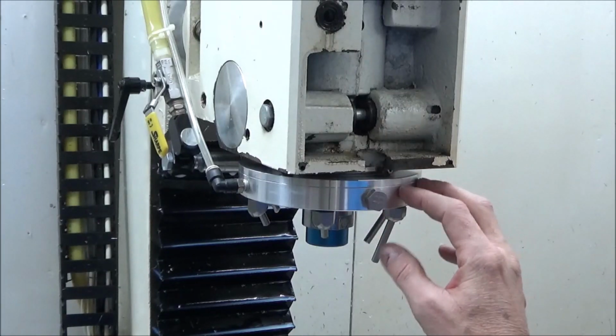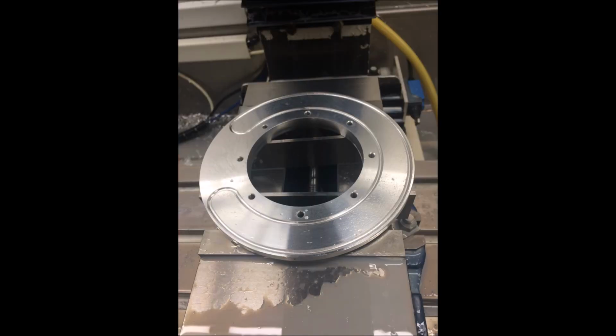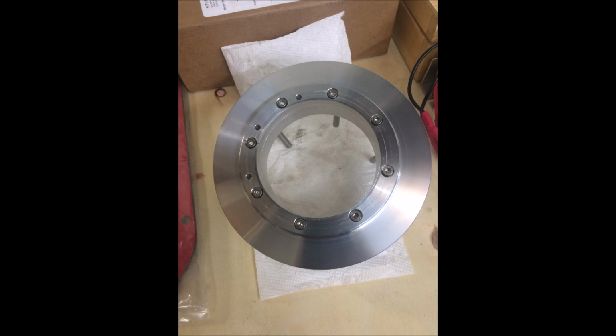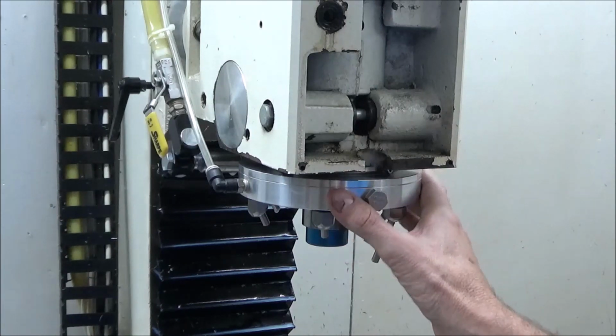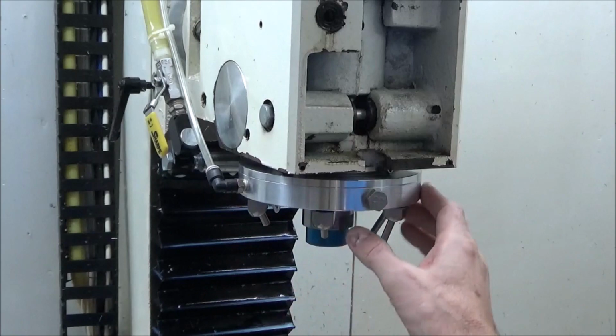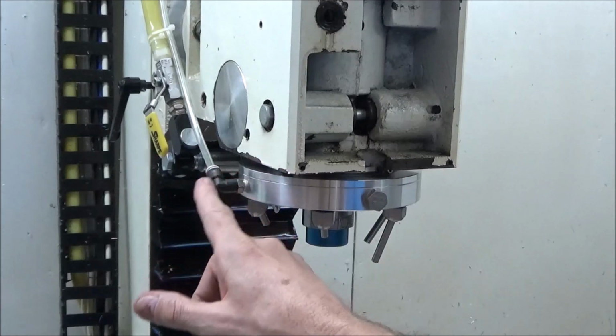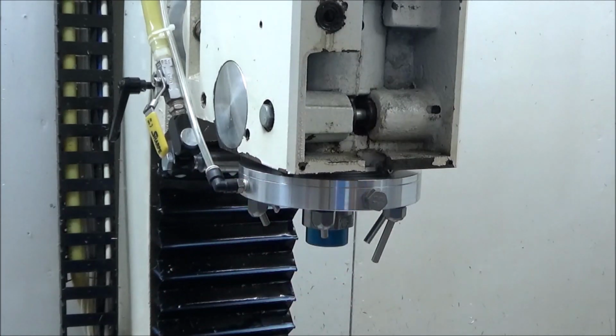It's just two machined metal surfaces together, and it seems to be sealing quite well, so I may not even worry about a seal there. And as far as the pressure from the air, this is totally separate from the coolant. This is just a through passage from this side down out this end here, so you don't have to worry about it blowing back into the coolant area or causing it to leak around the top where it's joined together.